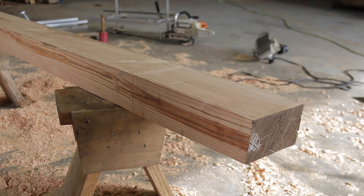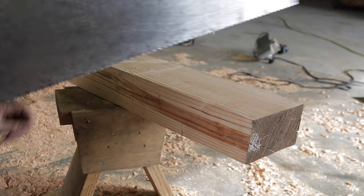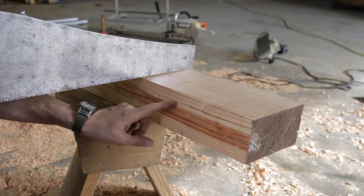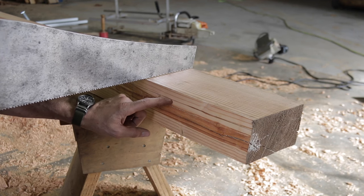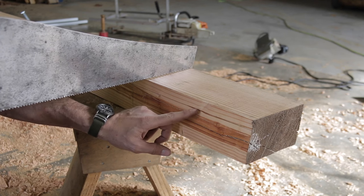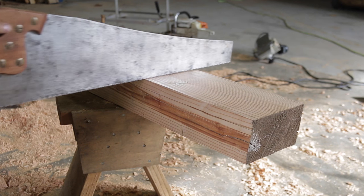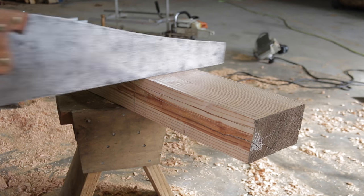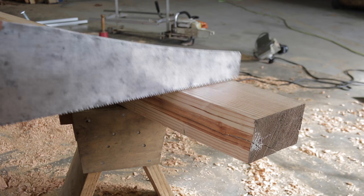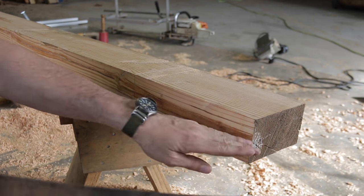The principle is the same regardless of how you do it. You don't want to chisel all that down by hand — it would take an age. What you do is take your saw, and with your marks there, remember we're going to cut two inches. We're going to take the mark away, cut down to the mark and then a little bit beyond. We're just a little bit smaller because we kept the mark on our mortise. You're going to cut strips like this every inch or so, right down to the line on both sides — not beyond — just right down to the line, and then take a chisel and knock those off.